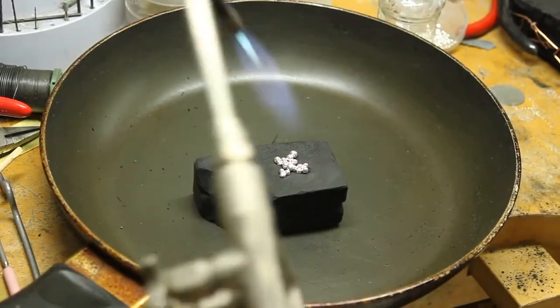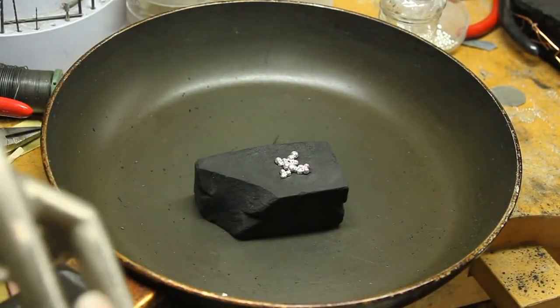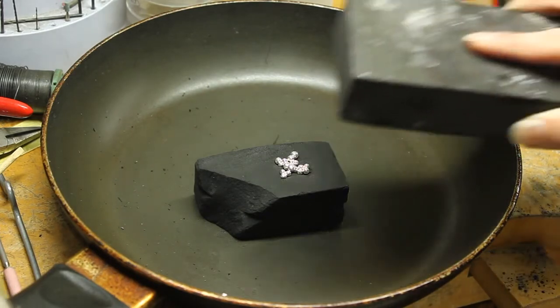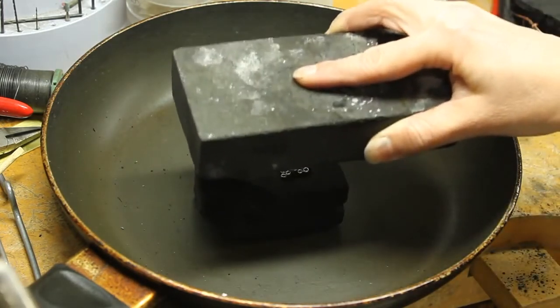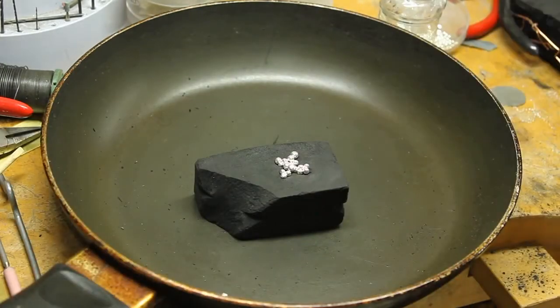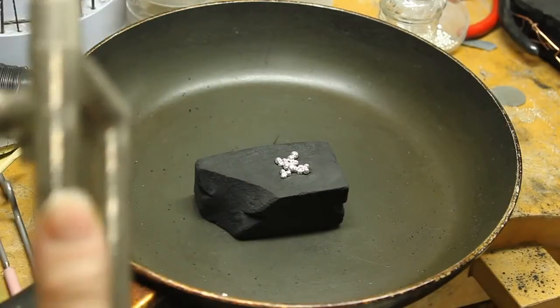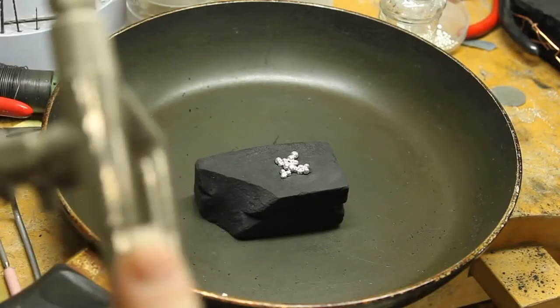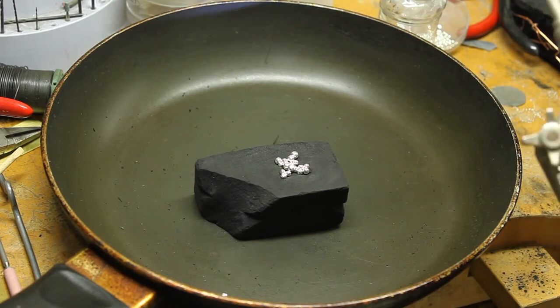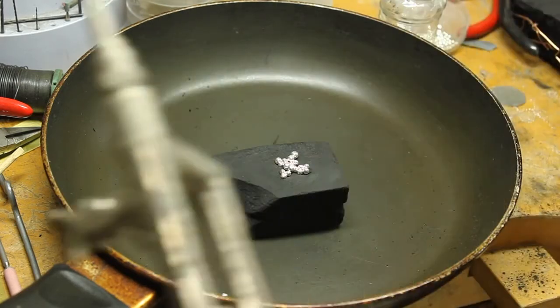Okay, so I'm getting ready to solder here. I've double checked, kind of gone through the motions prior to starting to solder, so I've checked that my block is really flat, and I know I'm just going to come in here and press parallel, right? Don't want to do it at an angle or it might push the metal elsewhere. Okay, so I'm going to try and do this so you guys can see nicely. All right, so I think my flame is a little bit hot. Just adjust it. Okay, we don't need borax, because the charcoal should take care of the oxidizing atmosphere.